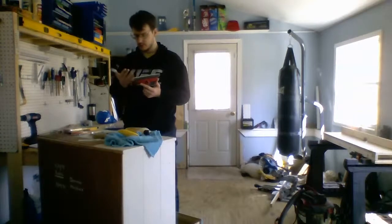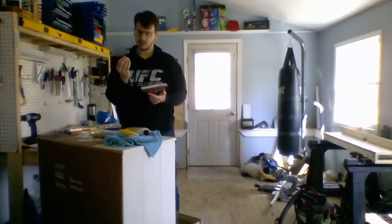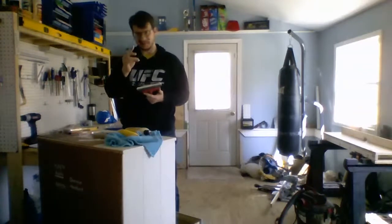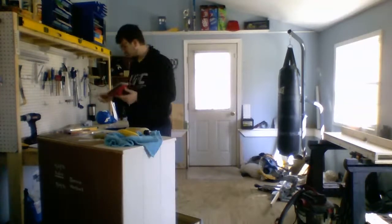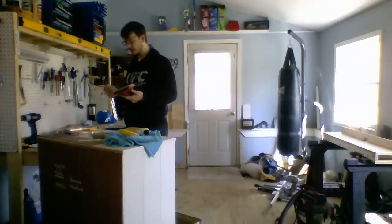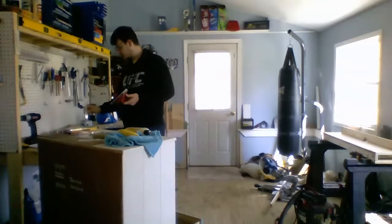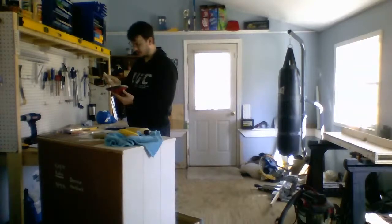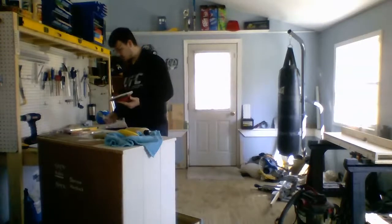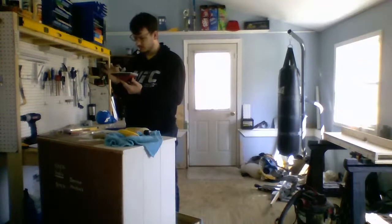So one thing I'm trying to do, and not being successful with, is to leave one of these flat surfaces bare, because I'm planning to glue these to the top of the box I'm making. But obviously, I shouldn't say obviously because I didn't know this, so maybe a couple of y'all don't know this. Glue does not work well on paint, so the glue would prefer to be wood on wood, not wood on paint on wood. So I'm trying to avoid getting too much paint on one of the faces. I'm currently not being successful with that attempt. But we'll see what we can do here. That worked better. Maybe a little too good.